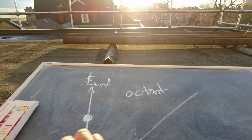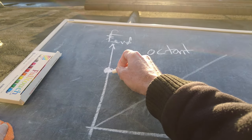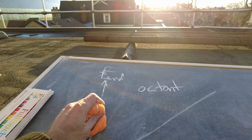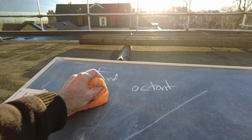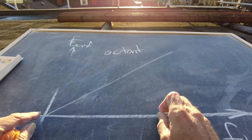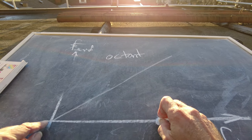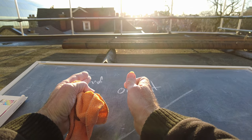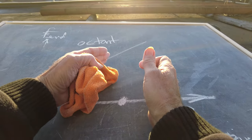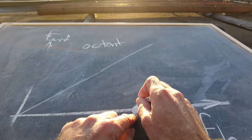So now an up chirp that starts at 0 hertz and goes to some positive frequency is going to be right on this line here. And likewise, if the starting frequency is some high frequency and then it ends at zero, it's going to be on this line here. So these are up chirps here, and then down chirps are over here. And if the downchirp goes all the way down to zero at the end of the time window, it's going to be here.